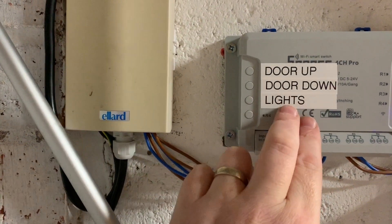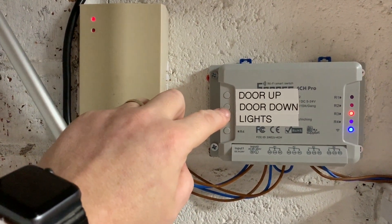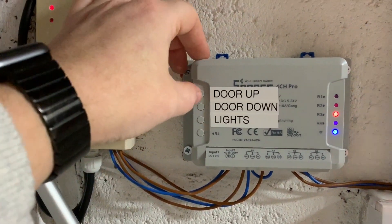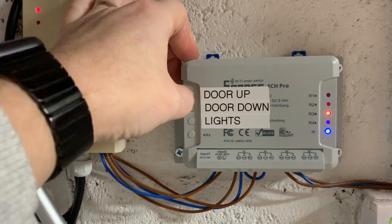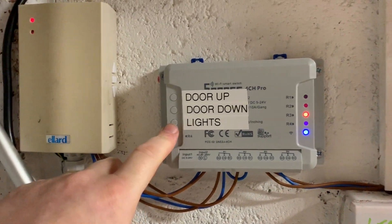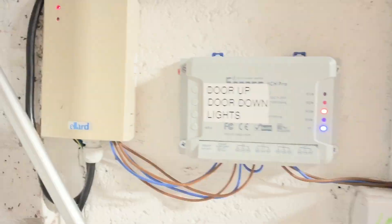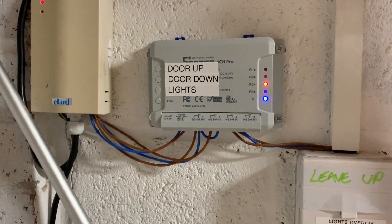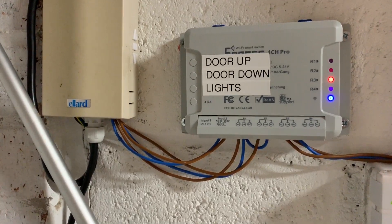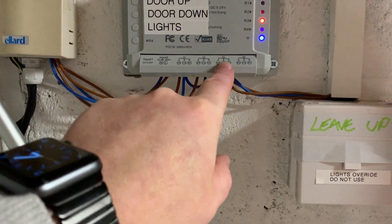I can close that panel up now. So I've labelled this up — you've got garage door up, garage door down, and then lights on channel three. When you use the remote control, it's going to this unit and doing the same as using these buttons. What I've set up in this unit is: when the door goes up, the third channel also kicks in. Rather than just being on for a moment like the up and down channels, with the light you can set it to be on and stay locked on using the dip switches inside. So when I put the garage door up, it not only puts the door up but also puts the light on. When you put the door down, it turns channel three off.